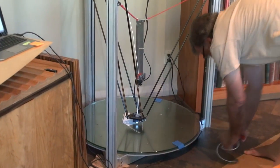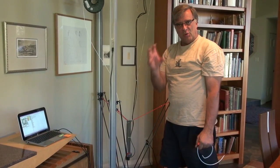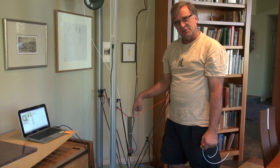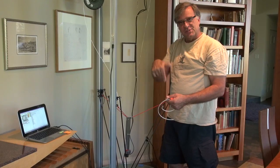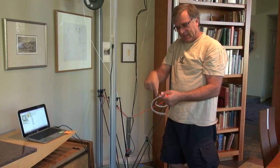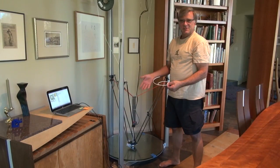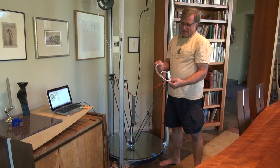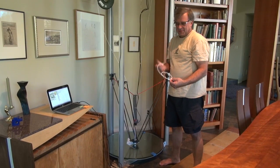And there will be no gap or anything? No, because there was still molten filament in the print head itself — in the extruder head. All I did was pull it out from behind and put the new stuff in. So it will pick up right there again and it should work just fine. There's no gap, there's no skip or anything like that in the print. You get about that much left over out of a full spool that you just can't use.